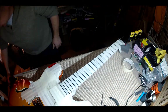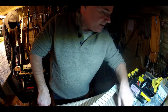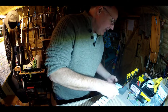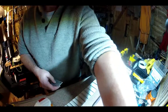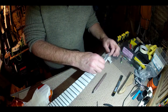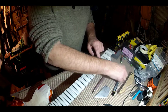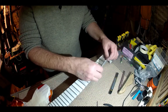Right, so here's the point where, for my curiosity and interest, I'm going to do a check of the number of uneven frets on this guitar. You don't have to do this if you were going to do fret leveling. You could just grab your fret leveling file and plow straight in. But I'm interested in knowing what the state of the neck is for general nerdish professional interest. So I get my fret rocker, I should say, and what I'll do is just start checking, looking for whether I can rock this backwards and forwards over the middle of three frets. And if I can, it tells me that that fret is high relative to the frets around it. So I just mark onto the paper where that fret appears to be higher than the surrounding ones.